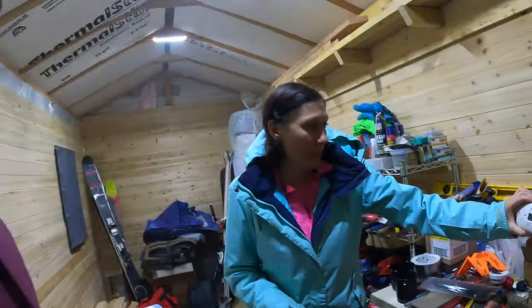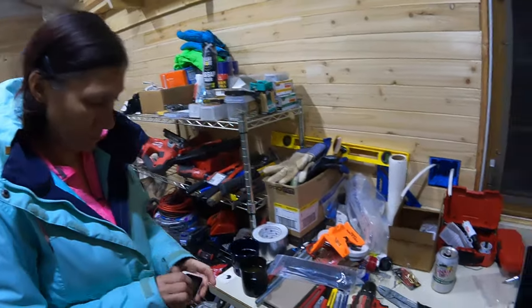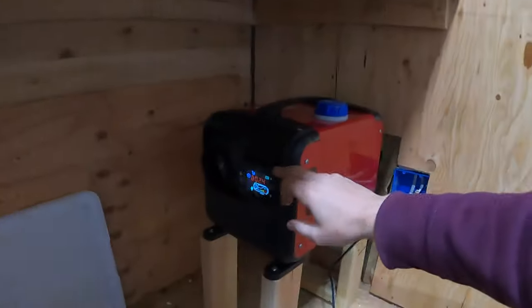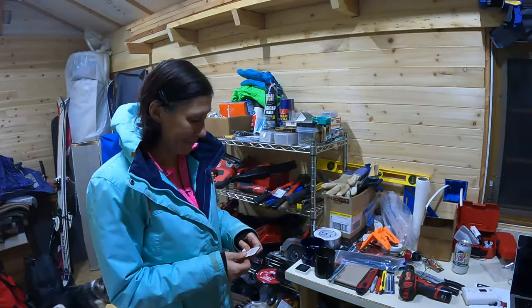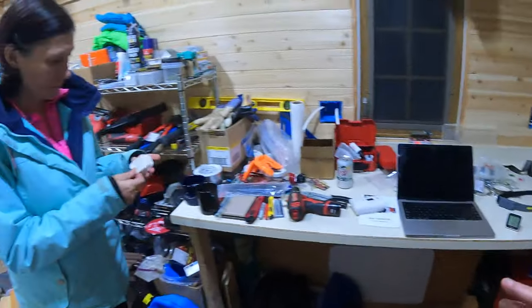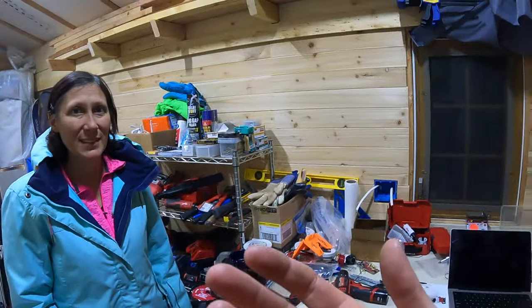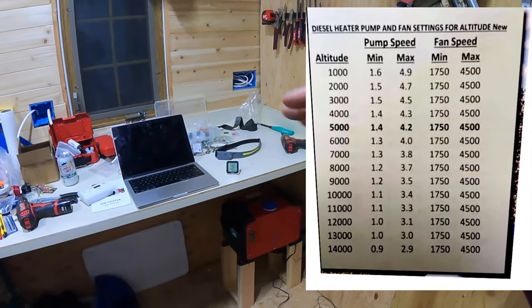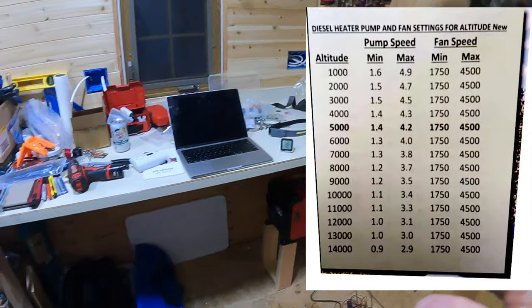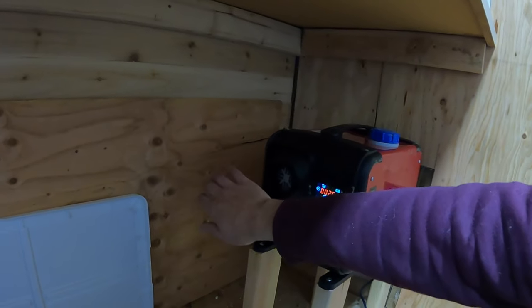I smell some exhaust — actually you're smelling the oils from the header wrap burning off for the first time. Have a fire extinguisher on hand just in case. The other thing we learned about diesel heaters is that this controller does not have an altimeter in it. The blue controller has a mountain symbol so you can supposedly run it at high altitude and it adjusts the fuel ratio and air automatically — but it doesn't. You actually need to set all that manually. Google it, or I'll put a graphic here. You need to set your max fuel pump rate, max airflow, minimum fuel pump rate, and minimum airflow based on your altitude, because if you run it too low when it's really cold everything will coke up.